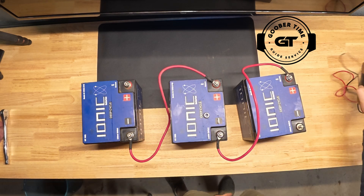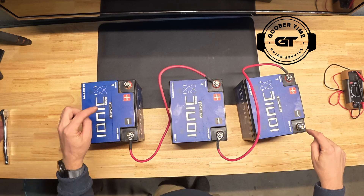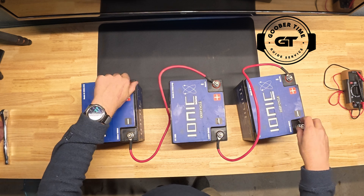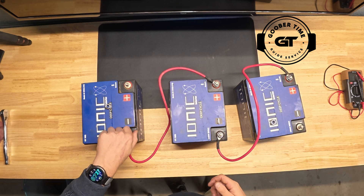I hope that information helped, but before you go crazy experimenting on your boat, make sure you know your accessories. If I had a 12 volt trolling motor and hooked it up to the positive and negative of this 36 volt system, I would fry it — I'm putting 42 volts to it. You want to make sure you're not overdoing it with the volts or you will destroy your equipment. Know what you need, use the appropriate system shown in this video, and I hope it helps you out. Write a comment below if you learned something or if there's something you plan to apply in your setup, and check out the linked videos in the description.